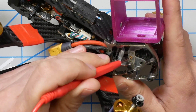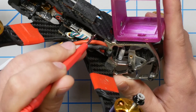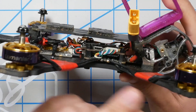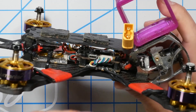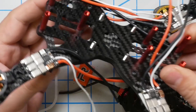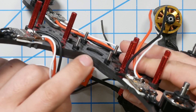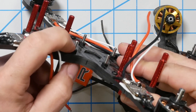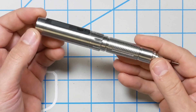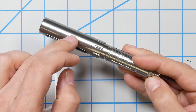There's any number of places it could be coming from. Got it to the metal here, ground here. You can see that there's continuity to ground all over the quad — just everything on the quad is grounded and that's pretty normal. So the fact that we've got these screws here touching the frame just means the screws are grounded, but everything on the quad is grounded and that's not a problem. It's completely normal in electronic devices for the case to be grounded, especially when the case is metal and therefore conductive.